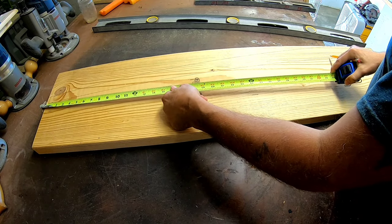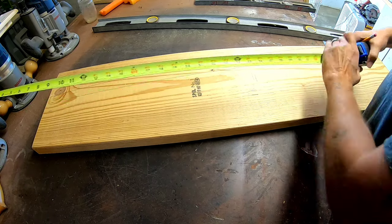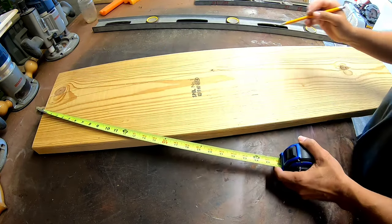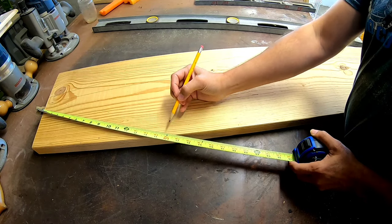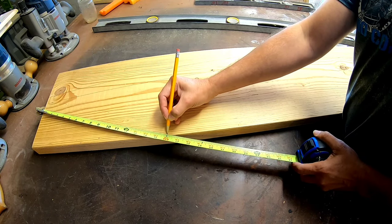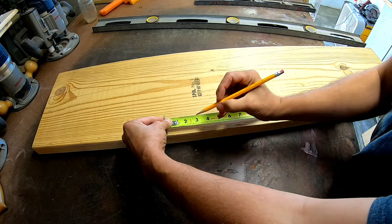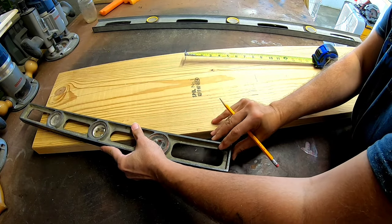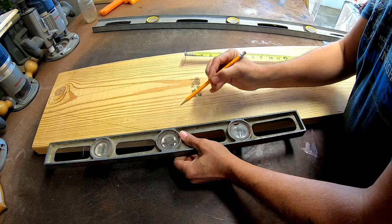I also come down right from the center down 25 inches and just make a mark across where 25 inches is. Then I come across to where the six and a quarter would be. At 16, you can go all the way over to the edge of the board if you want — you're going to round majority of that off anyway. I come in just a little bit, just makes it easier to find my marks. Then you come down two and three-quarter and put those marks on — from 16 to two and three-quarter.